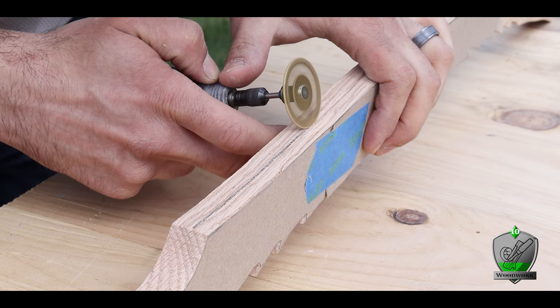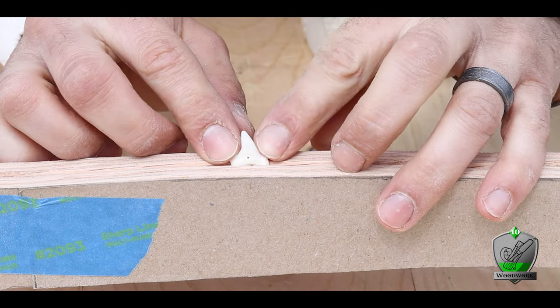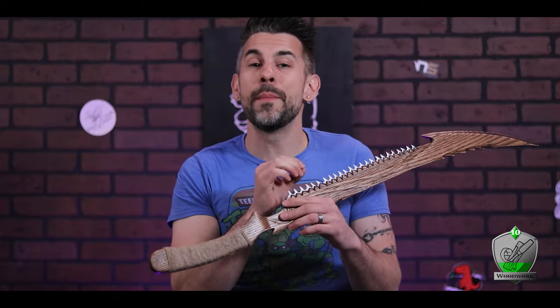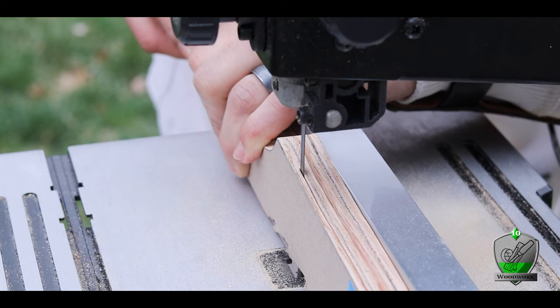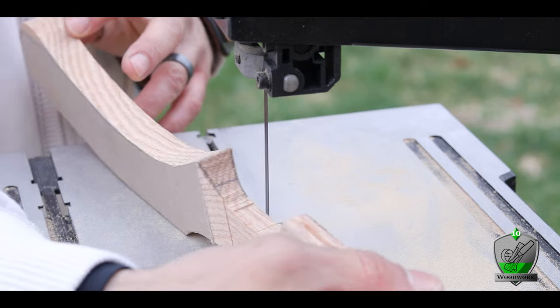Making the cut was really easy. I used a saw bit on a Dremel held at a slight angle, then busted out a file to open up the top of the channel a little bit. This worked out way better than I thought — the teeth sit perfectly straight in that channel. With the channel worked out, I drew a line about an eighth of an inch on either side of it, because I didn't want the wood to be too thin or it would break. I then ran it lengthwise through the band saw to thin out the blade, making the transition to the handle as smooth as possible.